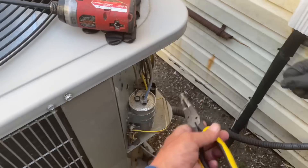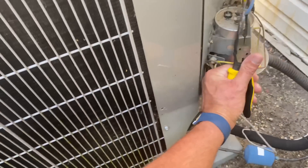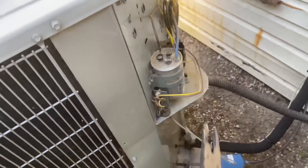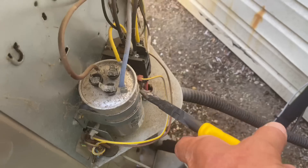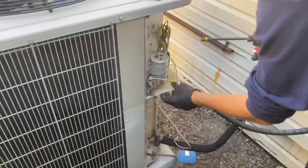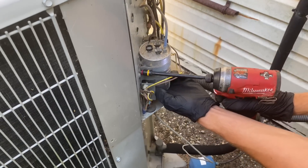Let's pull off the wires. Now, very carefully, remove that quarter-inch screw and make sure we don't touch anything over there - because if we short out anything to the coil side of the contactor, we're going to blow the fuse inside the air handler. And it's hot - it was boiling up in her master bedroom and I don't feel like making another trip. So take that quarter-inch screw out of there, and take the whole thing up out of there, and then we'll test this capacitor.